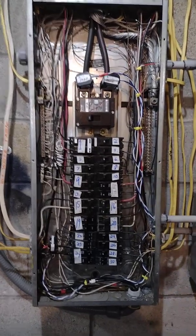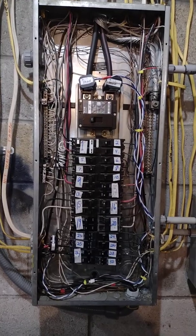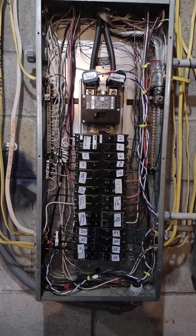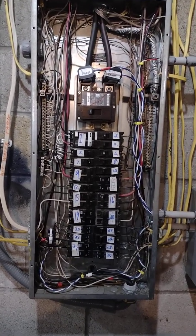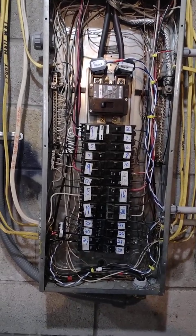The box you see before you is a single-phase 200 amp service, 120/240 — 120 phase to neutral, 240 phase-to-phase. I'm going to go over the phases because this is critically important, and this is what a lot of people leave out when they're wiring up the Envoy. Your Envoy will still work; however, you will get the incorrect readings.